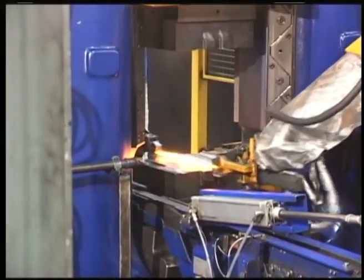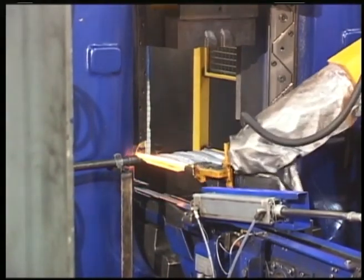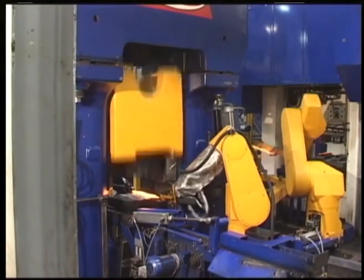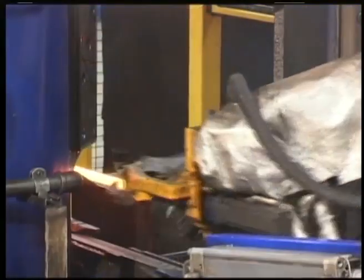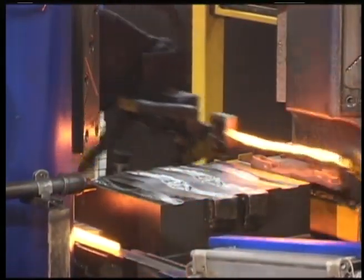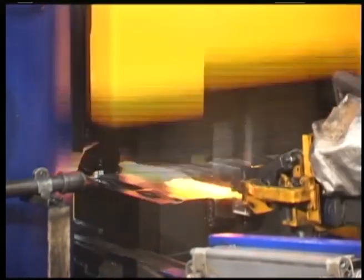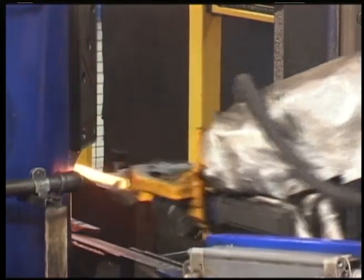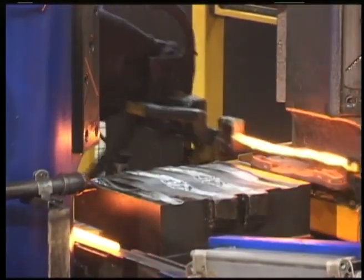One key to success is the repeat accuracy of the forging unit. Lasko double-acting hammers ensure that this condition is met. In the automation of forging machines, special consideration must be given to the demanding environments in the forging industry. Die forging hammers deflect during the forging stroke and afterwards due to the direct spring support used almost universally today. This is why they are not easy to automate using standard solutions. Lasko has developed special patented forging tongs that compensate vibrations as well as length and position changes. Experience has shown that there is only one successful concept for reproducing the operation of the blacksmith.